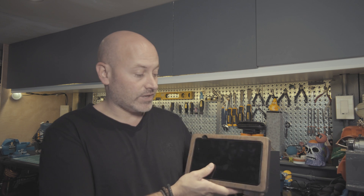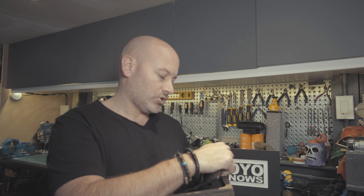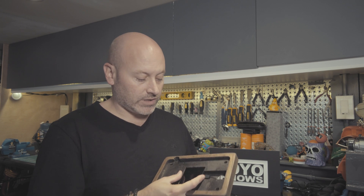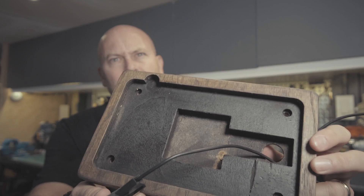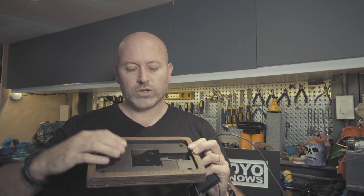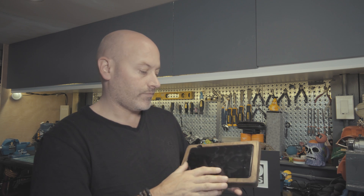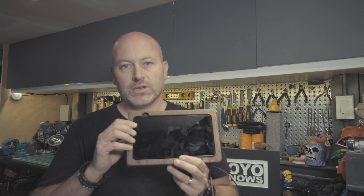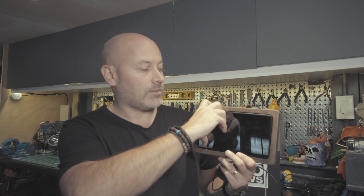As an example, a project I did with the Carvey: I have this wall-mounted case. I've done a few of these with different designs. Essentially, I used two pieces of plywood and carved them out separately to create an enclosure. The tablet lifts out of it, and it's been custom milled to fit a wireless charging block into the bottom. I milled the whole thing out using the Carvey — you can see the holes on the back. The wireless charger fits flush, I mount that on the wall, the tablet fits in, and the magnetic backing from the wireless charger holds the tablet in place while it charges. When somebody wants to access the tablet, they can just walk up and pull it right off the wall.